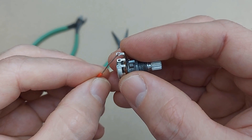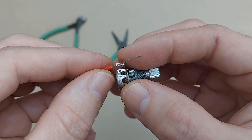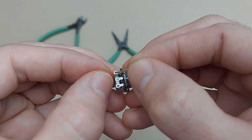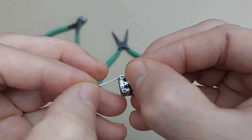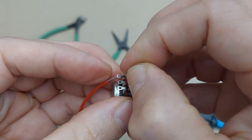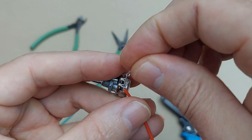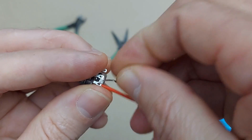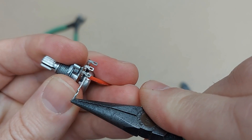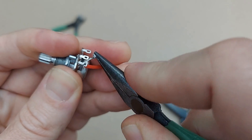I take the knob and pass the wire through that hole in the leg, pulling it up until the insulation is as close as possible. I don't want to wrap the wire around the terminal loosely because all those wrappings are just going to come undone. Instead, I pull it through all the way close to the insulation and begin my wrapping using the top section. With each wrap I'm going to pull this wire as tight as I can so that it's hugging the terminal tightly. You'll probably want to use a pair of pliers.